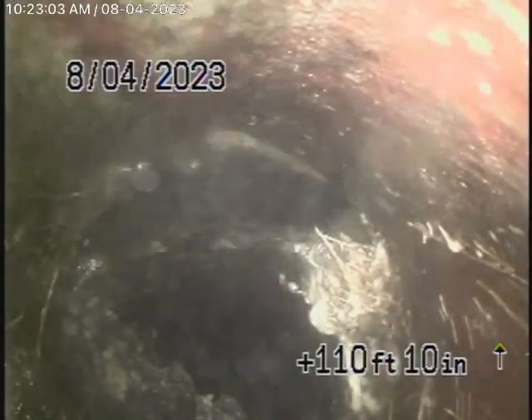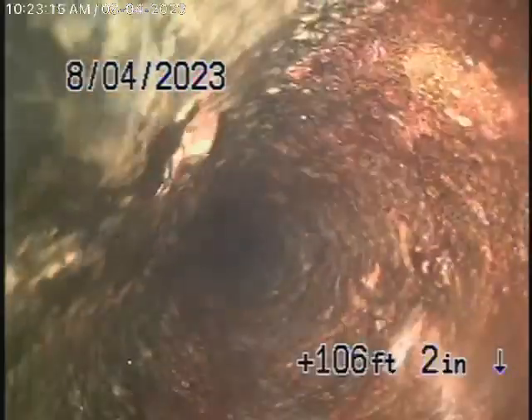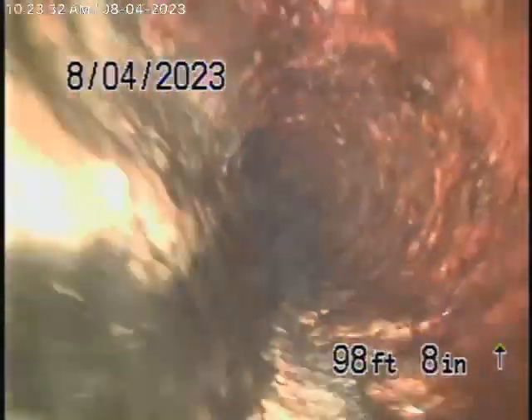We're going to bring the camera back from here. You can see pretty heavy roots, and it comes back to a cast iron pipe that's getting pretty old. This is way out by the sidewalk — we're underneath the sidewalk, far away from the back unit. This pipe is going underground, and that's obviously an old cast iron pipe.